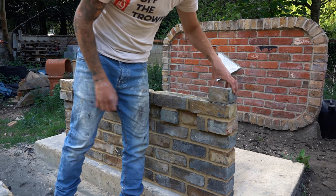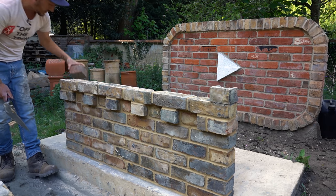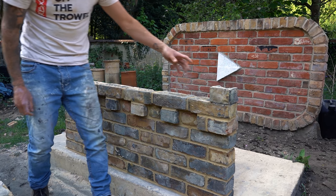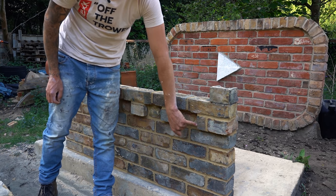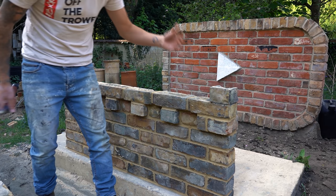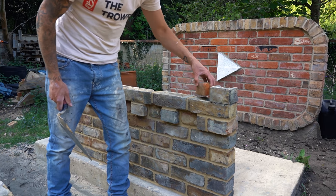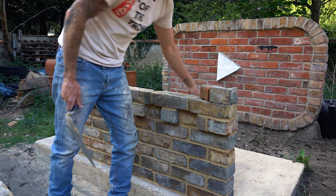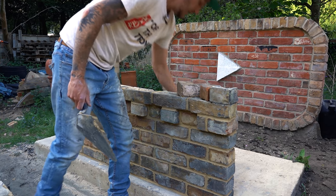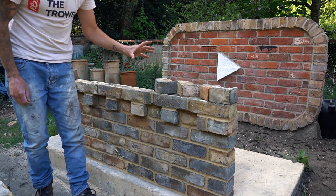Now what I like to do is put a half bat on each end, but we're doing all this dry first — we're not actually laying any bricks yet, so you just set a couple of bricks like so. You can put a queen closer in the end if you want to, you don't have to. I personally prefer it this way but it's completely up to you. From here, what we're going to do — I've already got these cut — is cut our dog-tooth. I've obviously already cut these ready prepared and I will show you now exactly how to get these cut.